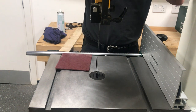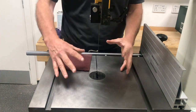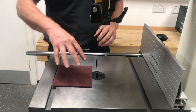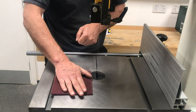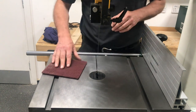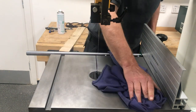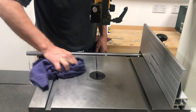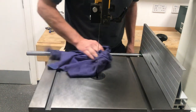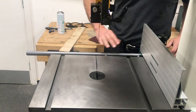We've got a build-up of resin around the main cutting area. On any bandsaw with a cast iron table, if it's got to a stage where it needs a lot of work or you've left some wet timbers on there that have soaked in and stained the table, you can remove the blade, use the scratch pad again with a little orbital sander and a light bit of pressure — as it's rotating it's going to give you a nice even cleanup all the way across the cast table. You can also get into the miter slots as well.